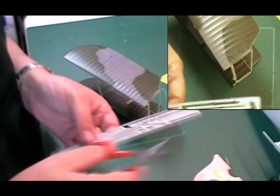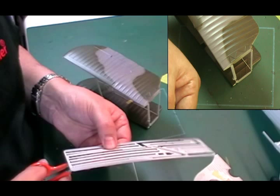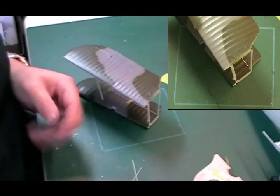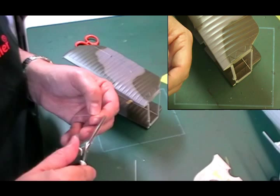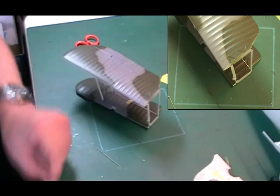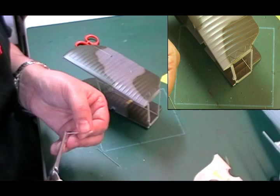There's another good reason why I'm not snipping them all out first and just sticking them in — some of them aren't that far apart in different lengths, and consequently I don't want to be in a position of not knowing which one I've got. Same thing with these — we just bend them down. I don't bend them totally to 90 degrees, I tend to do them to about 85 degrees — that way they push in and slide in a lot easier. Once they're in there we can give them a bit more of a nudge.